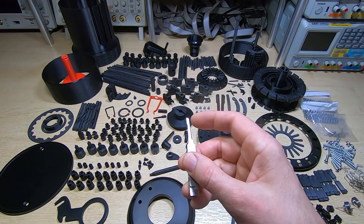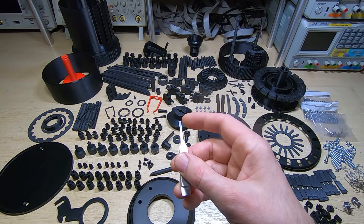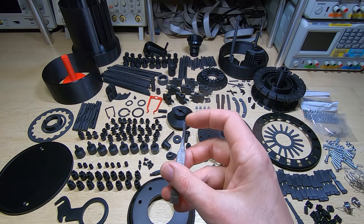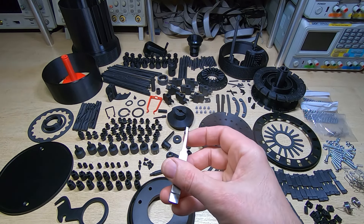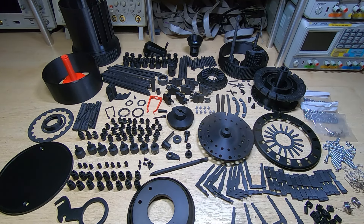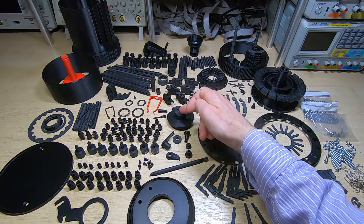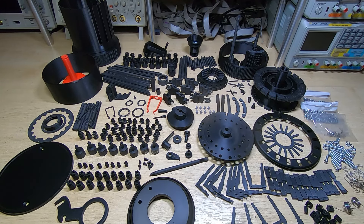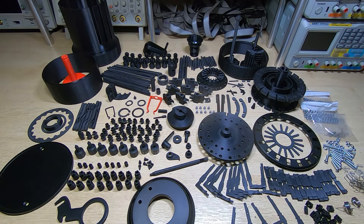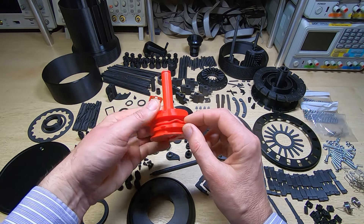When the part comes around again it rubs even more and you end up with a horrible smeared surface. What you want is a very sharp tool with a very small contact area, plenty of clearance, and I also usually add a little bit of water while cutting. That results in a very nice clean surface finish. Anytime you see clean surface finishes, chances are I've used a cutting tool on the lathe to finish the part, which also allows very good tolerancing.